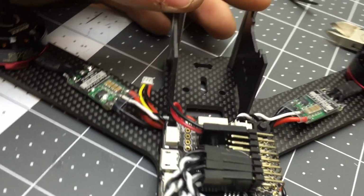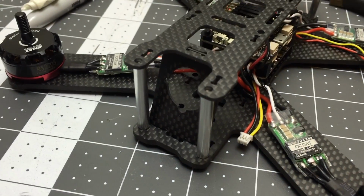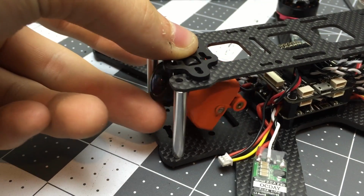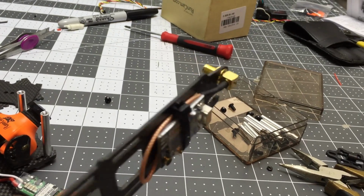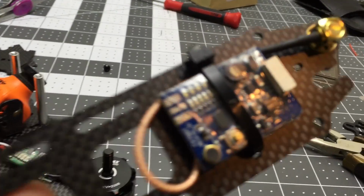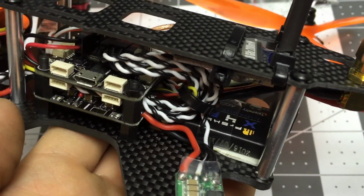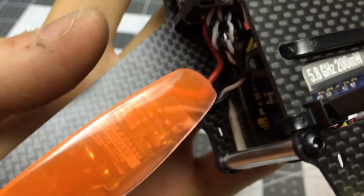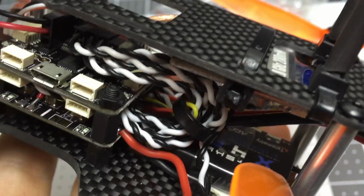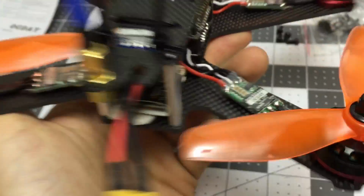You could use these wall mounts for Foxeer style cameras if you want, or this plate for board cameras, or maybe the lens mount, or I'm just going to use the floor mount. I'm going to mount my video transmitter to the top plate like this, and I'll list where I got all these other parts too in the description. Make sure that your wires are secure and won't come out into the prop arc, because that is a very close fit right there. Alright, so maybe put a zip tie around your extra wires just to kind of keep them in the middle there.